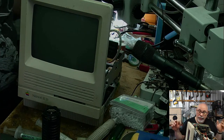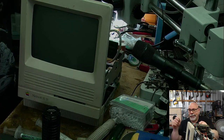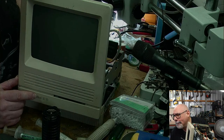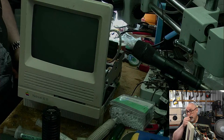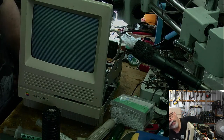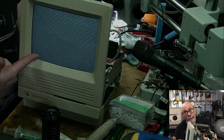And we've got this board here. We're going to test it out, see if we get a chime or a bong or whatever you call it. So, dun, dun, dun, dun. Here's the moment of truth. And sad Mac chimes. Not too concerned about that. It could just be the memory. Oh, this is exactly what they were talking about. Horizontal lines and sad Mac.